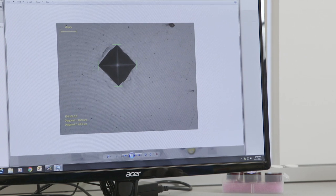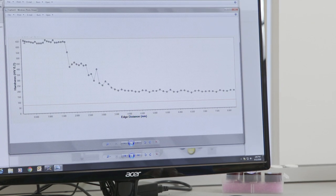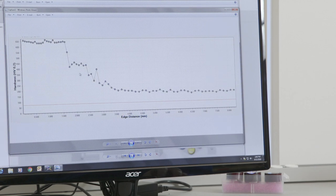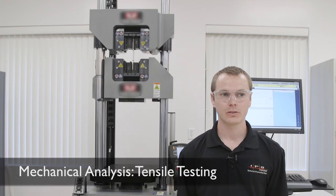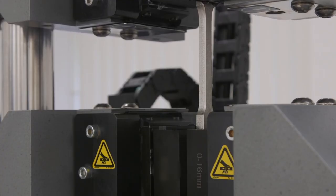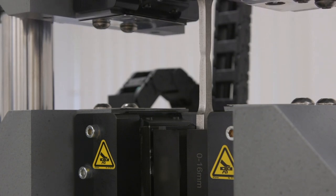We can have typical graphs showing many micro hardness measurements along a line crossing the weld zone, heat affected zone, and base metal. You could have some hardening in the weld zone, some increased hardness in the heat affected zone, and softer base metal. Many of our customers have specific strength requirements, and we design the process to meet those strength requirements while providing consistent, clean, repeatable welds.